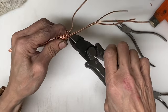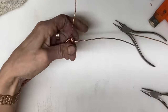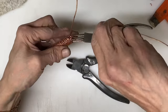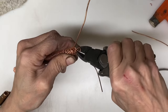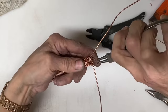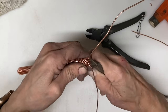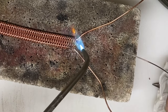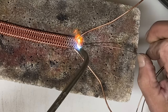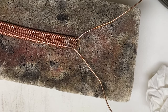Now we are going to work on the opposite end — the inner two wires. I am going to peel back some of the coils and cut the two 14 gauge inner wires down as short as I can get them, then rewrap some of the wire on the top to hide those two inner wire ends. Then I am going to solder in the two 14 gauge wires as well as the ends of each of the three coiled sections.